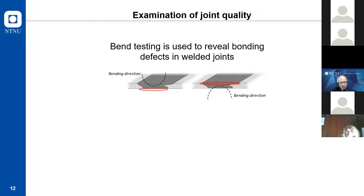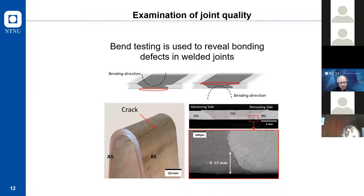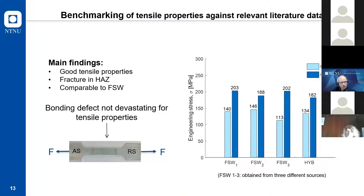One critical qualification for offshore structures is a bend test used to reveal if bonding has defects. The first trials were unsuccessful with the first generation of I-Bond technology. After improving the technique, optimizing the process parameters, we overcame all problems related to the bend test, which is the first requirement for offshore structures.